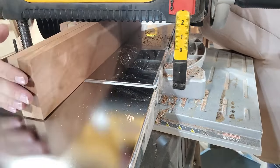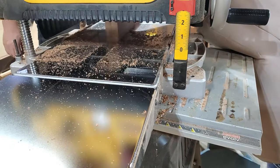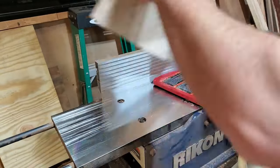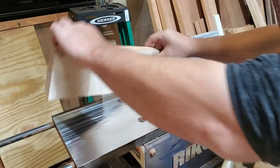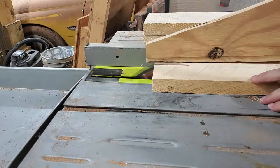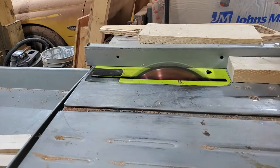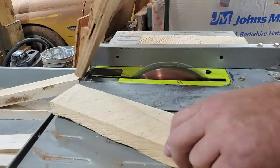At this point we don't have our thickness down to its final thickness yet, because whenever we glue the grout in between the pieces we're going to have to plane it down again — that's where we'll establish our perfect thickness. Then double-check to make sure they're all squared up. Now it's time to start milling down some wood to make the grout. We're going to prepare this for two separate glue-ups: one is the strips going between the sapele pieces, and the other is a glue-up of just maple, getting ready to trim it down into end-grain pieces to be the grout. It's important to do it this way to make sure all of your grout grain is end grain. You don't want to mix grain directions — if you mix end grain and side grain you run the risk of your board coming apart.